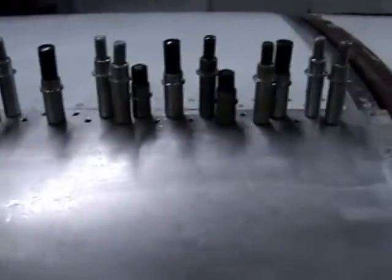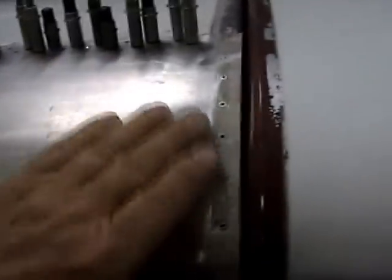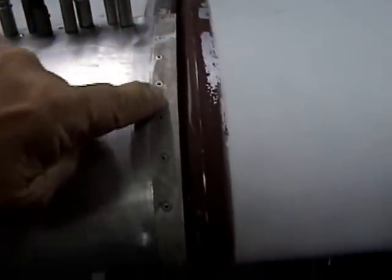Okay, well, we've got it all nailed down and bonded. And so everything's clecoed in place, and rather than going ahead and grab the rivets wet, we elected to leave it like this, let it cure. Go back in because we don't want to take a chance on anything shifting. Is this sucker so smooth now? It's just incredible. Went ahead and ran the AVEX rivets in this side to nail it down to that rib, because these are going to be covered with the gap strip that goes across here. And man, this sucker looks like a dadgum porcupine there, but not a bad job, huh? And that is a bunch of Clecos. It's so sweet.